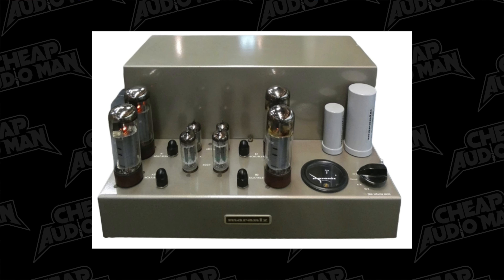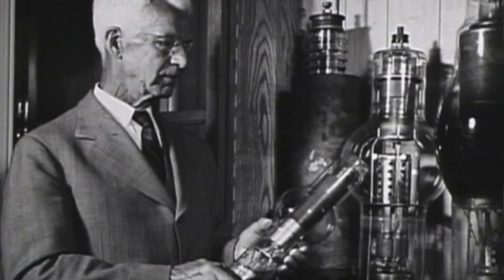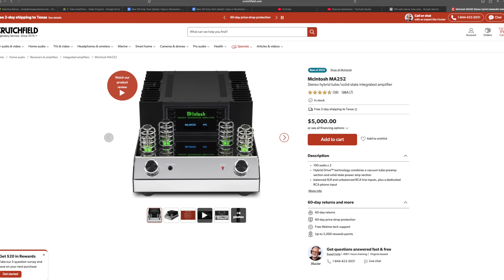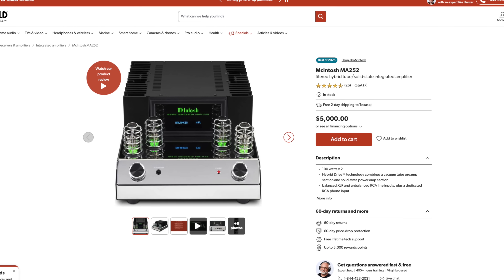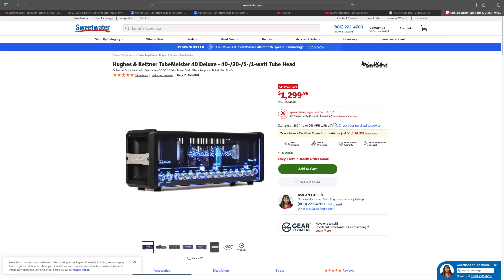We're going to talk about tube amps. I'm going to leave things out, but put in the comments what I'm leaving out, and if I got anything wrong, please feel free. Tube amps have been around for a long time — everything from communication to playing back music. They used to be ubiquitous in all of those console stereos. And you can still buy them today. People still love them. To get 100 watts on a tube amp, well, it's complicated and kind of difficult, because they use glass tubes and output transformers with huge voltage swings. People love tube amps and tube guitar amps too, because it adds warmth and, more importantly, even order harmonic distortion.